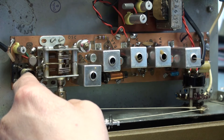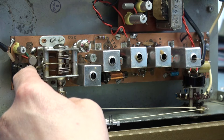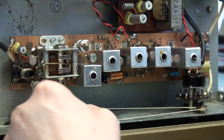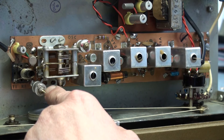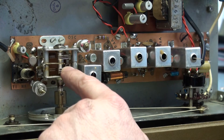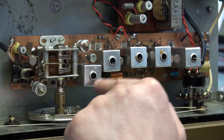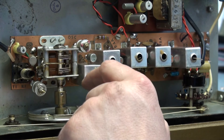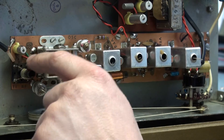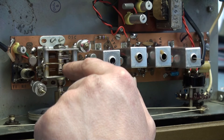You've got the inductor — a variable inductor here for low frequency matching of the aerial — and a Plessey trimmer capacitor here for the high frequency end. This basically gangs to this tuning gang here, and these two here: the local oscillator coil and the oscillator trimmer for the high frequency end. Those two gang to that one, these two gang to that — this is how you match the RF front end to get maximum performance out of the set.